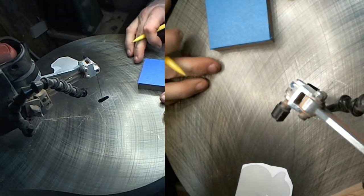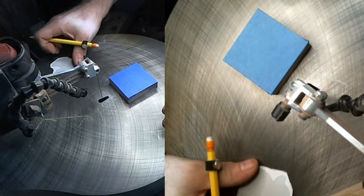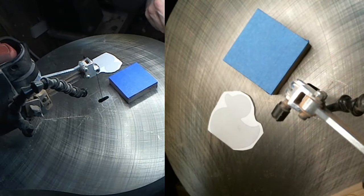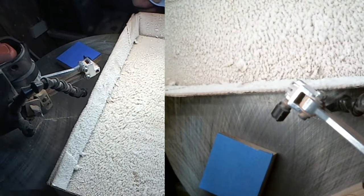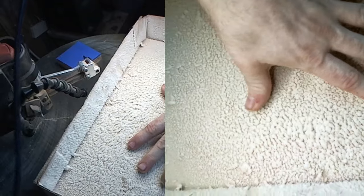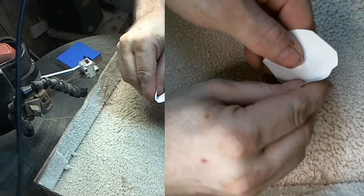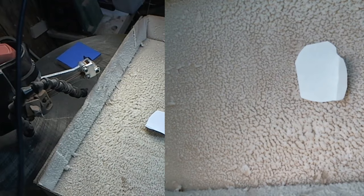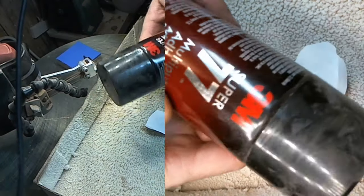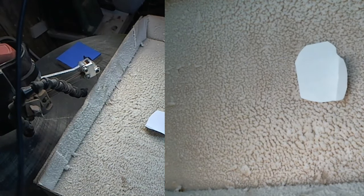What I do most of the time is use blue painter's tape — sometimes packaging tape, sometimes I'll just glue the pattern right to the wood. For this example I've got blue painter's tape. This box here is what I use for the spray adhesive — it catches all the overspray. What I like to do is take the pattern and put a little kink in it so I have something to grab. I'm using 3M Super 77. I've used a lot of spray adhesives in my life and I always come back to Super 77.